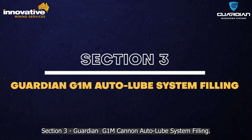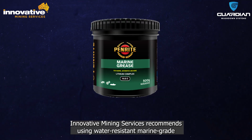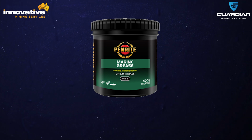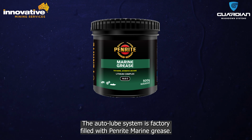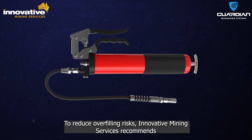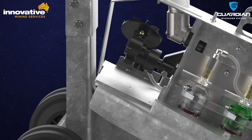Section 3. Guardian G1M Cannon Auto-Lube System Filling. Innovative Mining Services recommends using water-resistant marine-grade grease for the G1M cannon range. The Auto-Lube system is factory-filled with Penrite marine grease. To reduce overfilling risks, Innovative Mining Services recommends that a handheld lever or trigger-style grease pump be used.